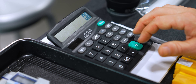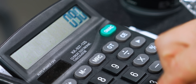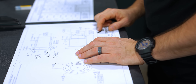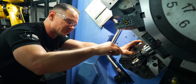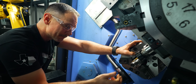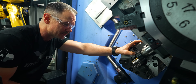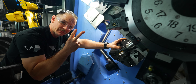We're nearing the end of Op 1. We went ahead and put our 60 thou hole right in our thread relief, then went ahead and bored the part out. You could do that in reverse order if you like, but I wanted to bore it out and then come through with that drill one more time to hopefully knock that burr out, because a burr on the ID right there can be a pain sometimes. With that, let's go ahead and part this off and get to Op 2.